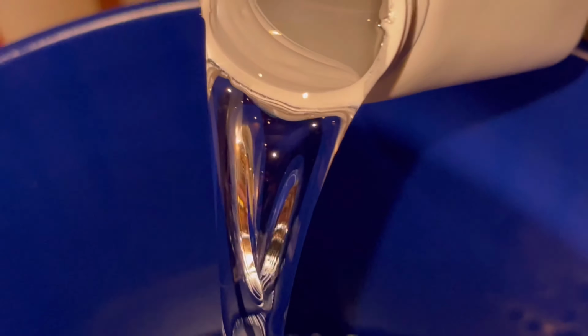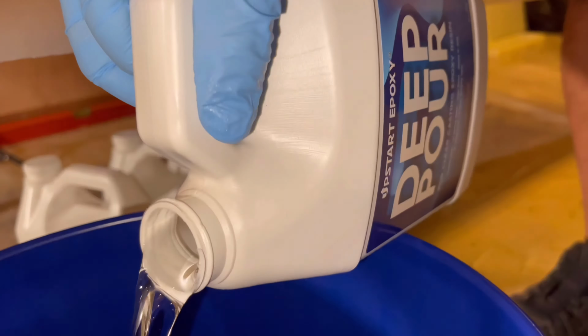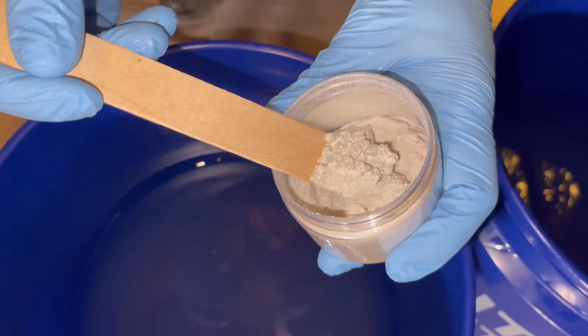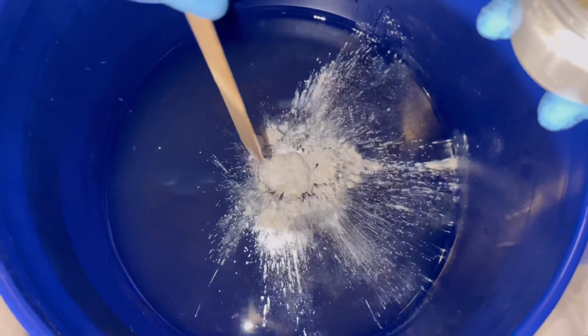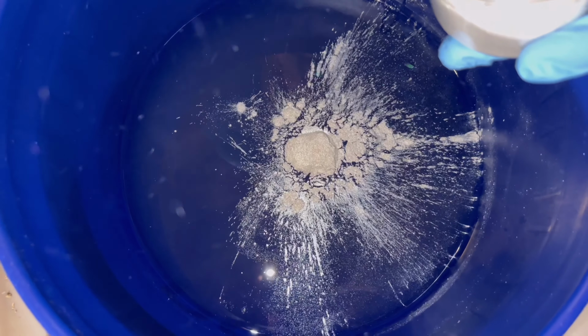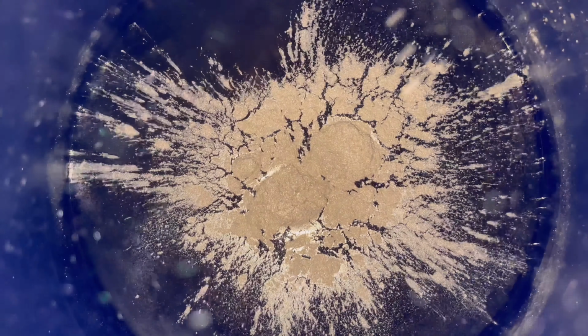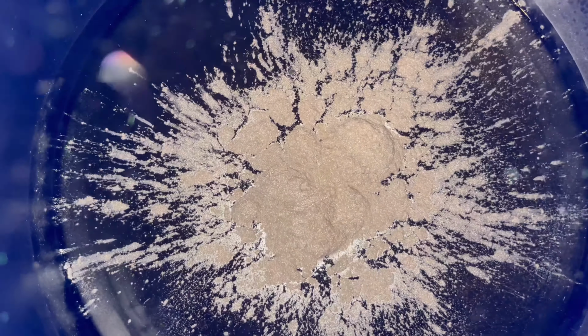So yes, we're going to pour it up to 2 inches, but you always want to make sure that when you're pouring at this level of volume, that you have some fans or something to cool down the epoxy as it's curing in your room. For this pour, we used a couple of fans on each side just to keep it cool. It was going to be 2 inches, but spread out through a huge platform. So we wanted to make sure that everything stayed nice and cool.